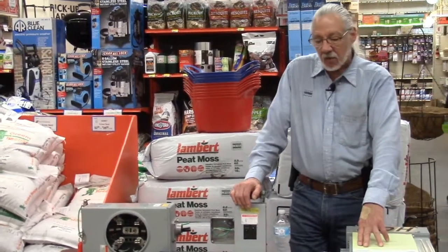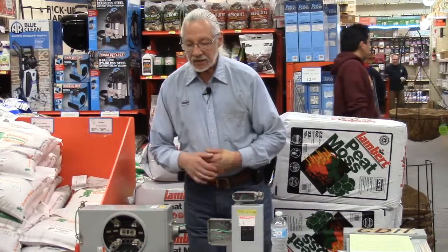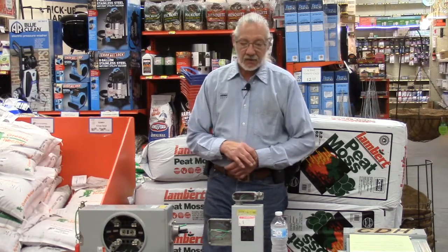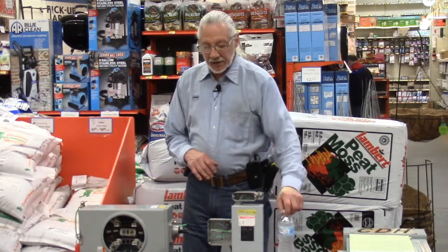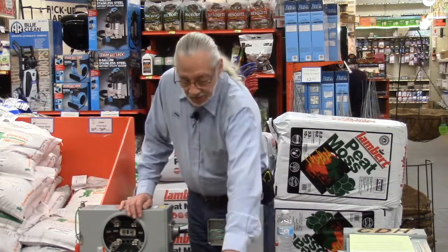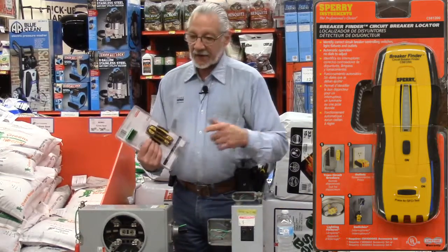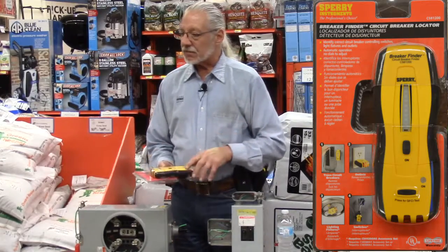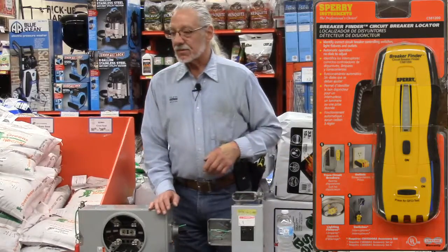Evaluate and identify what you have on your current panels. And why I say that, because when you start playing with the wiring, you're probably going to want to know where each one of those wires go. So what I would do is, when you get up in the house, you can put a tracer on any outlet and go down and find out what breaker or fuse that goes to. So you're mapping your house is what you're doing, and identifying different rooms with different breakers.